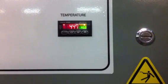Calibration is done by first measuring the temperature on the machine. You're going to run a temperature strip through the machine. If the temperature strip shows, let's say, 400 and the controller is currently showing 450, then the controller is off by 50 degrees.